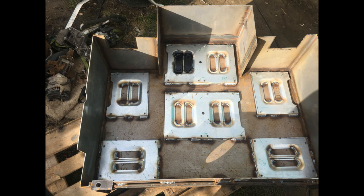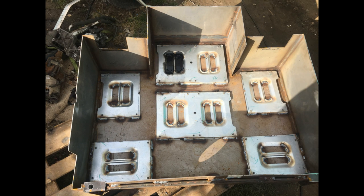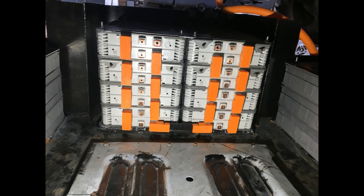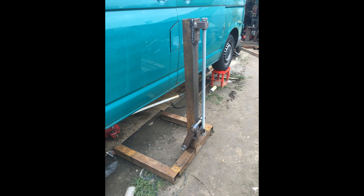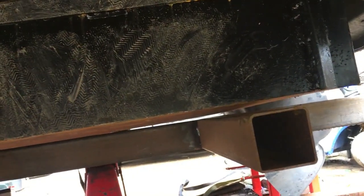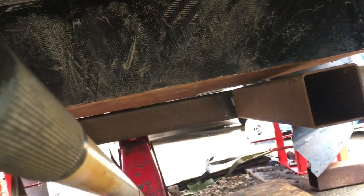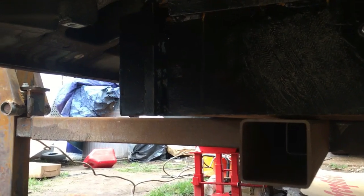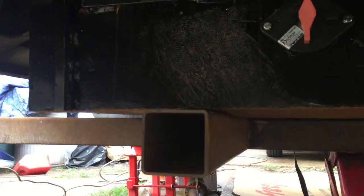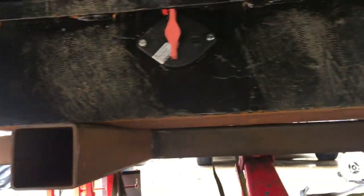This is the battery box. I used templates to work out the shape and size. It took quite a long time. I've used parts from a Nissan Leaf — those bits you see welded in the bottom of the case actually came with a Nissan Leaf battery. Those are some of the cells. My cells are second generation; it's a 30kW battery. That's part of the lifting mechanism — I've got one on either side that I use to actually lift the battery into place. It's quite weighty — about 280-ish kilos — and it's going to get a little bit heavier, but that will be in a later video.